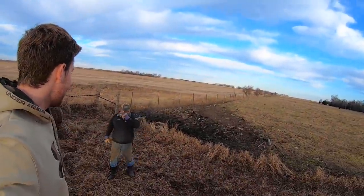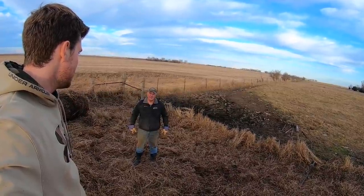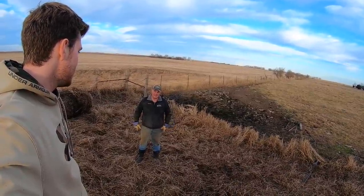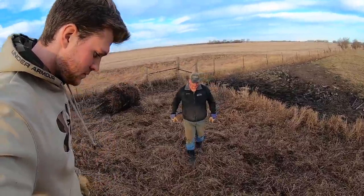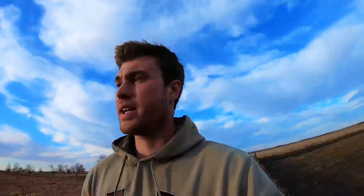How far are you stepping and what's the distance? Well, five steps is a rod — 16 and a half feet. It's about 15 to 16 and a half feet, so I'm just trying to take big steps and make it a rod every post. All these posts are laid out. We've got to put the hammer back on the bobcat and we'll start pounding them.